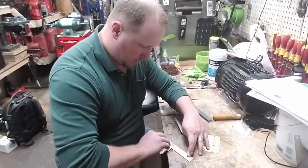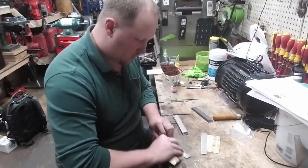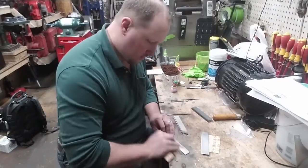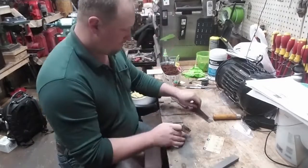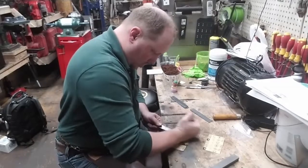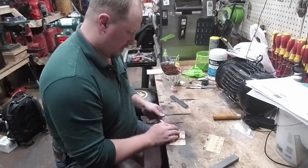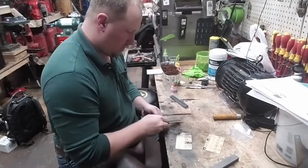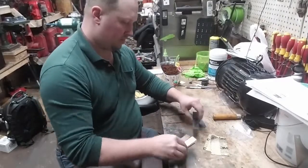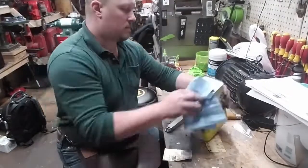The first thing we have to do is material prep. In this case, with surface prep. The steel has been sitting for about a week. We've got to make sure that it's bright and spotless so that our weld can be free from any potential contaminants. Even the untreated mild steel has to be sanded the same way. There we have the color difference. I think that's a nice little bit of contrast.